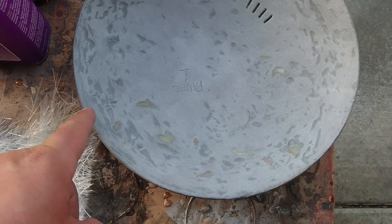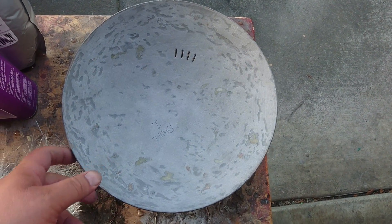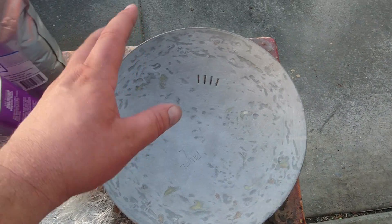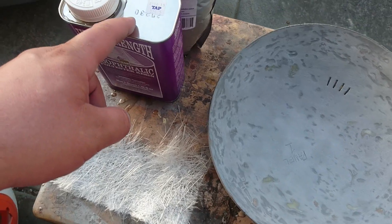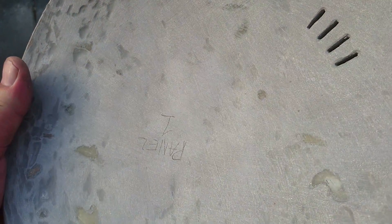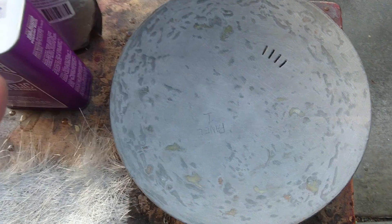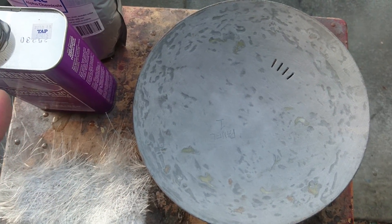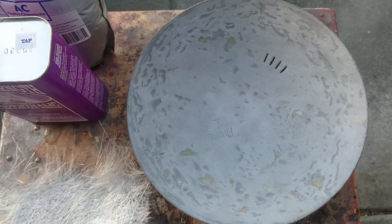So the plan with this is, once I get the triangle pieces printed out, the edges are still untouched so we can still glue parts to this. The triangle panels will be fiberglass in the same similar manner, and then we brush in the resin and aluminum powder mixture to kind of coat the whole thing. So it gives it not only an aluminum finish, but it kind of finishes the whole thing and creates a stronger part.